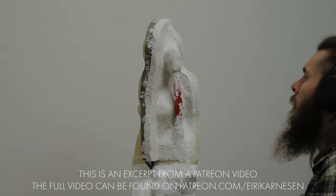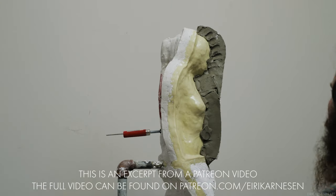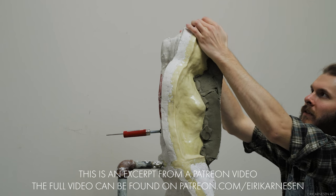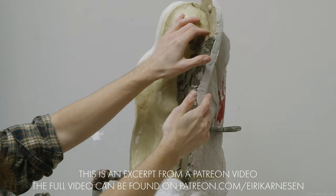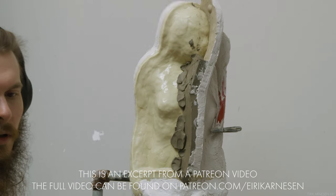Once our model mold piece is made, one of the pieces making up our model mold half is finished and completed, and we can get rid of the clay wall. It has served its purpose as a stand-in for a plaster wall, but now we have a plaster piece with a plaster wall to make the next piece against. I like to wait until the next day before removing this clay wall since the plaster needs a little bit of time before it's properly sturdy.